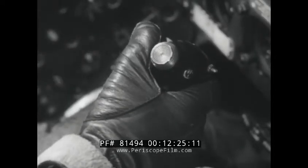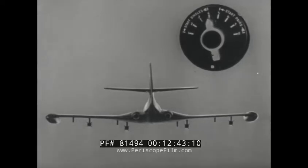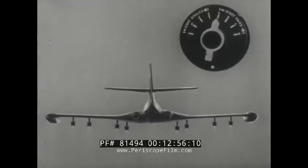The bomb and rocket release switch is on the control stick. If the station selector is placed in number one position, launcher station one is fired. Selector position two fires station seven. Selector three fires station three. Selector four fires station five. As the selector is rotated in order, stations eight, two, six, and four are fired. Rockets or bombs may be fired in pairs by originating the fire order in positions five to eight inclusive. Pairs are fired symmetrically from outboard to inboard as the station selector is rotated from five to eight.